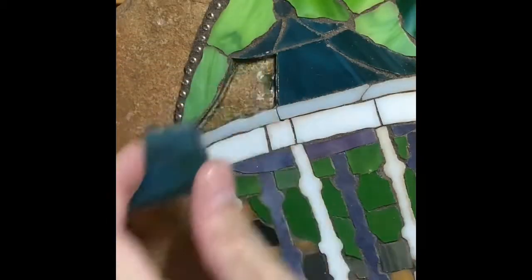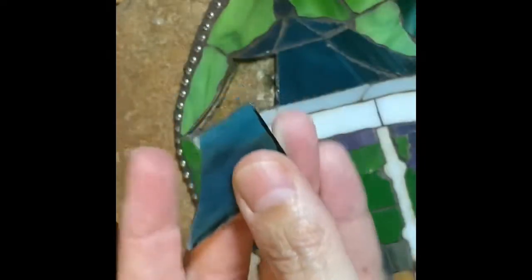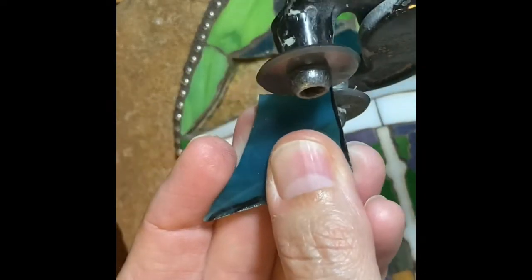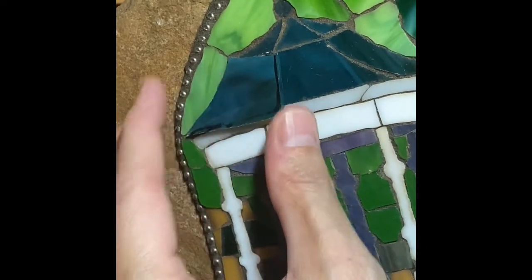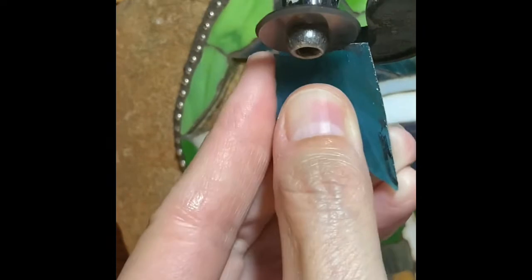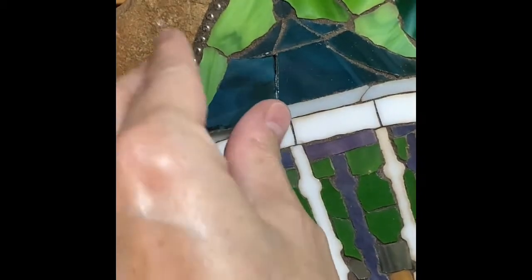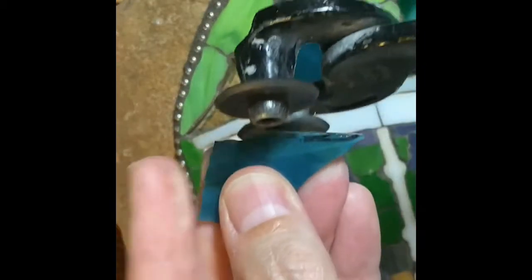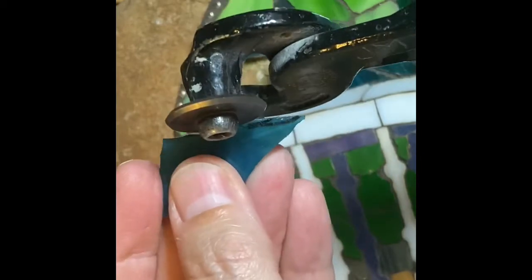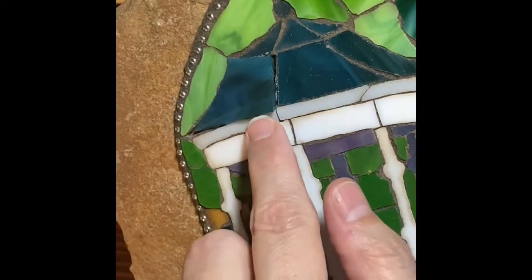Let's see how it fits. It's a bit too big and that's good — I'd rather have it be a bit too big than a bit too small. So I'm just going to be nipping it to fit and going back and forth nipping and seeing how it fits. This line and this line are pretty good. I'm going to work on that back diagonal. That looks pretty good, and now I'm going to go along the bottom. Because this is a repair, I'll probably go ahead and grind this to make it smooth from all the nipping. A little bit off this corner and it should fit.